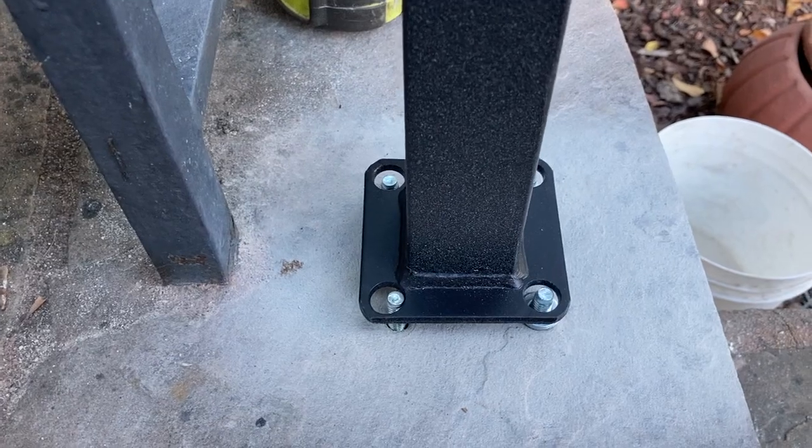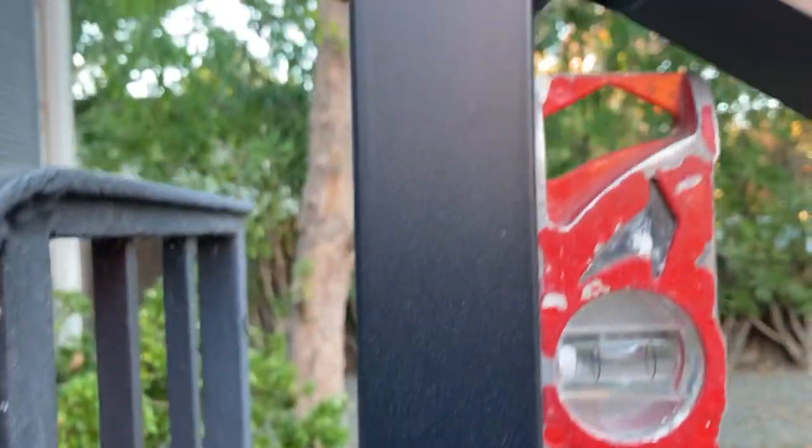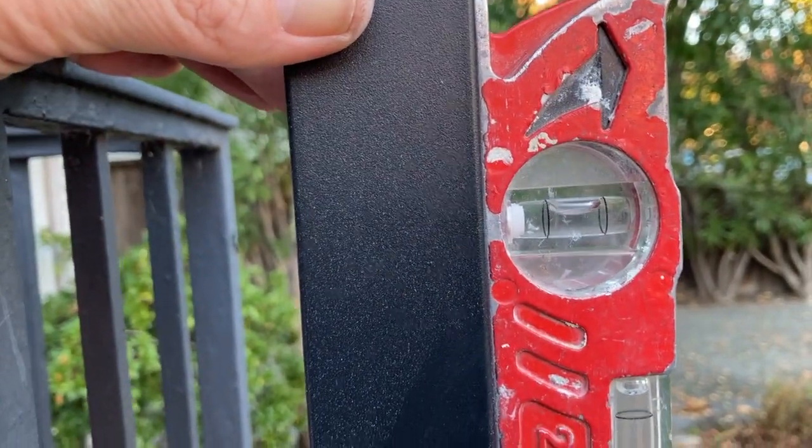Okay, so now sort of set the railing on here with everything loose, right? I got a level on here, see? And also it should be kind of parallel with this, but you see, got my level on here, and these washers are gonna help. Got it on down here. So keep it all loose for now.